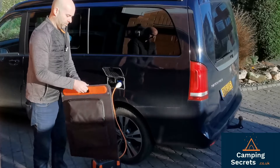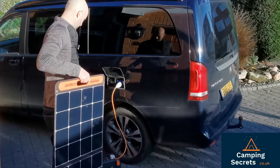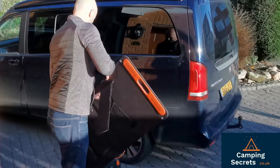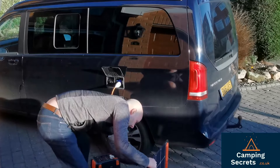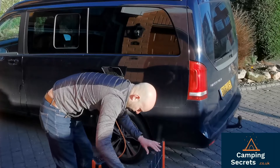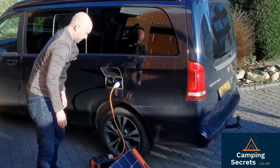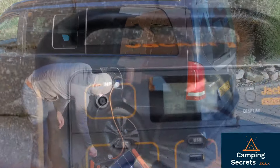Can we use this portable SolarSaga 100 watt solar panel to subsequently charge the power pack, which then subsequently keeps the campervan charged up - my grand plan. There is some sun here but nothing quite where I'm parked, even so it should show the principle. We unzip the solar panel - it's got a cable on the back that directly comes from the MPPT controller inside the solar panel. These are great solar panels, I've reviewed it separately so check out our video on the Jackery solar generator. Then we simply hook up the cable into the input of the Jackery.